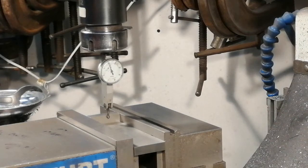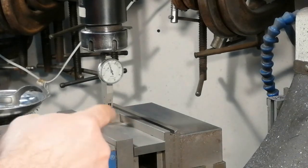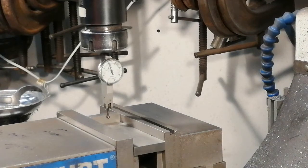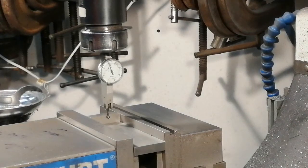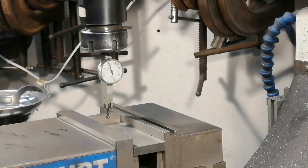I have a very simple setup here. I have a test indicator which is half a tenth — just over a micron. I have gauge blocks, the cheapest grade: grade B or 3, depending on which scale you use. I have them set up like a T. The Y axis is locked, because if you start moving the Y axis the whole thing wobbles, producing huge differences on this very precise instrument. The idea is that I check here, then move the column up and check against this crossbar, without moving the Y axis at all. The spindle is also locked.